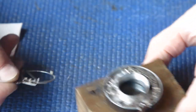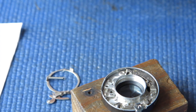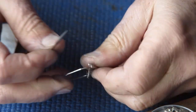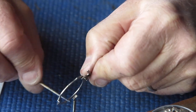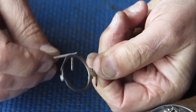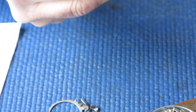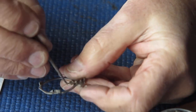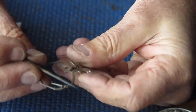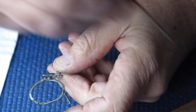With the shutter release in place, next we need to put the main lever on the shutter. A wipe of molybdenum around the inner and outer surfaces - you don't need much. And on the bird pawl, that's this thing here, a bit on there and a bit on that little guide post at the tail end of it is all that's required.